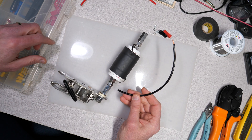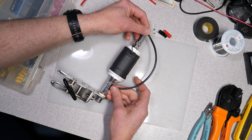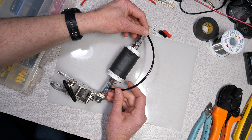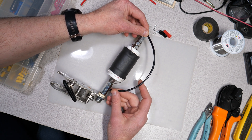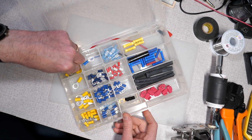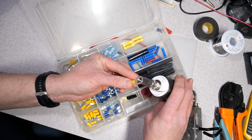To make the bypass, you'll need a suitable piece of wire. Mine is about 9 inches long, which is about perfect for the Sporty 40 coil, but you can use a longer piece if you want to bypass the Silver Bullet Mini or Silver Bullet 1000 coils. Next, you'll need a couple of ring terminals. The inner diameter will need to be big enough for the 3/8 by 24 threaded connector to go through.